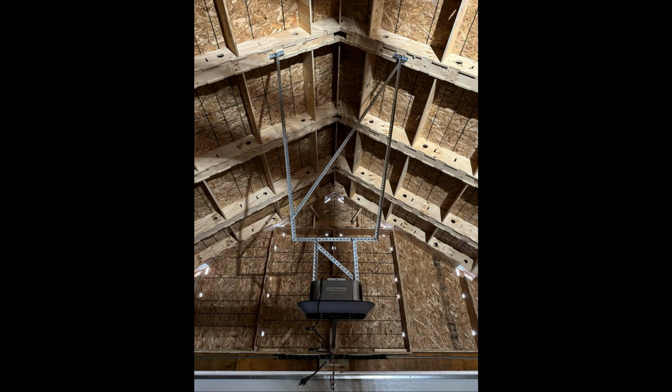So there gets to be a point that honestly, just get a jackshaft motor. If you're going to do all that angle and stuff, just get a jackshaft motor, and that's an 8750-4. It's already a pretty expensive machine. Just get the jackshaft. Ideally a Genie jackshaft, because they don't have a bunch of problems like the 9802-2s do, which, by the way, a little side note here, we have had 9802-2s with the updated software that have still done the force erroring. Just something to think about.